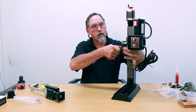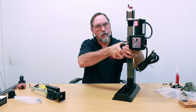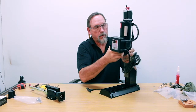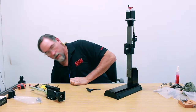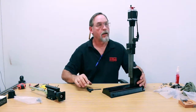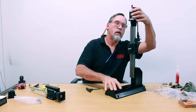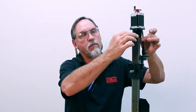This one's got a headstock with a riser block — we're just going to take that whole assembly off of here. Now we're going to have to remove the saddle and the entire lead screw assembly. The easiest way to do this is to take off the stepper motor and then remove the two 8-32 screws and pull the entire assembly out.